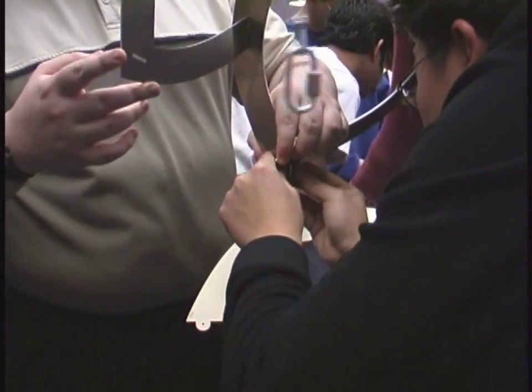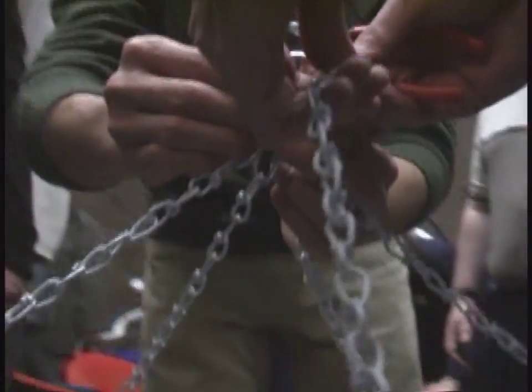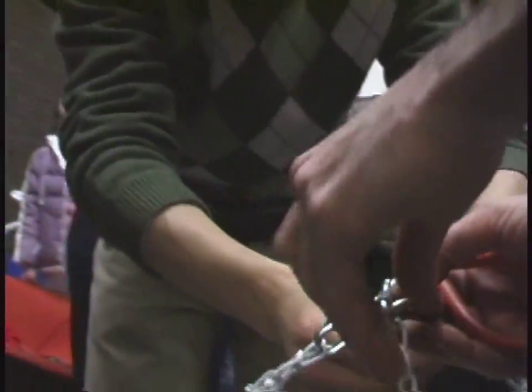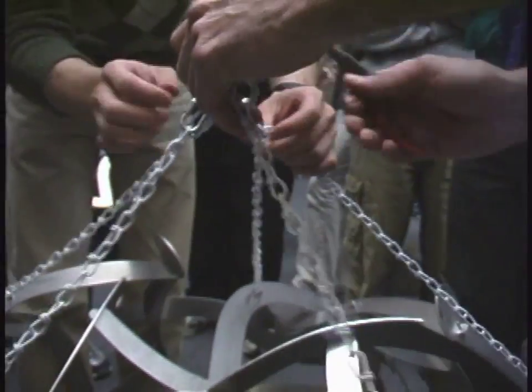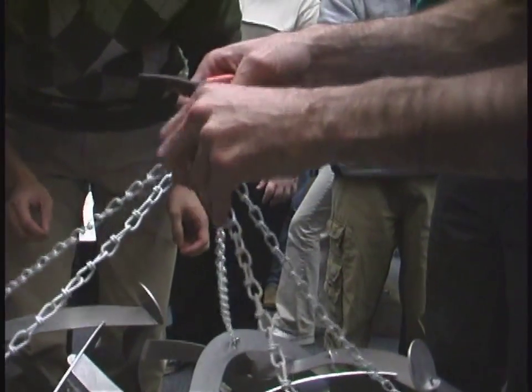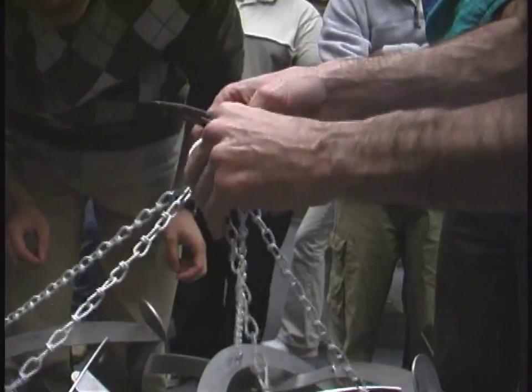We did this for the first 5 modules that all have the chain on it, and together they make a cap of 5 that's like the 5 triangles at one vertex of an icosahedron. The chains from these 5 points join together, and they link to one welded ring here which carries the whole weight of the whole sculpture.